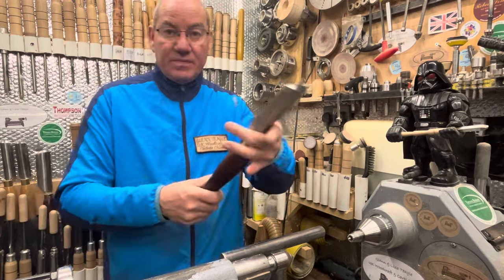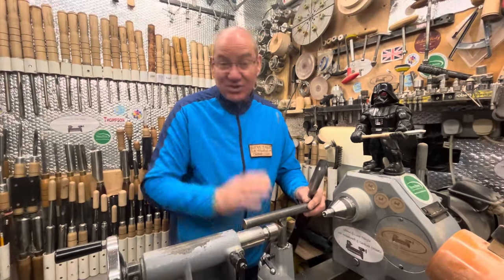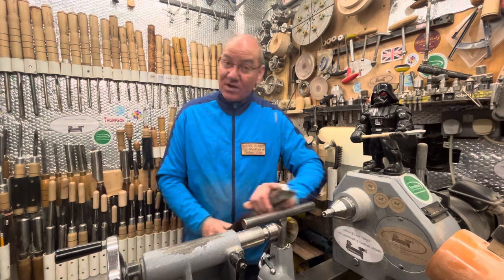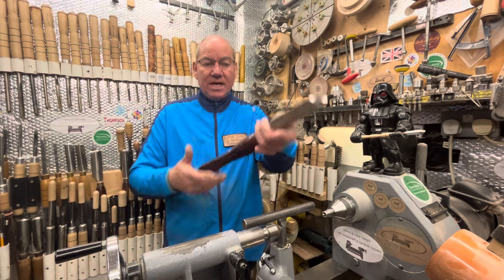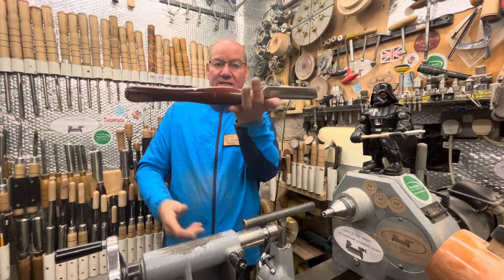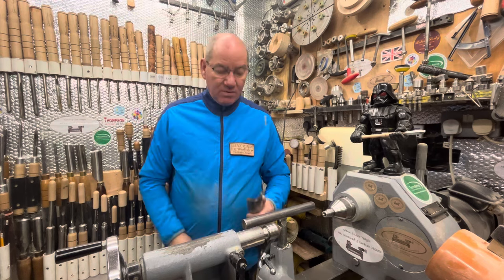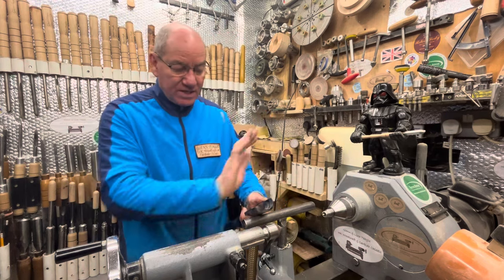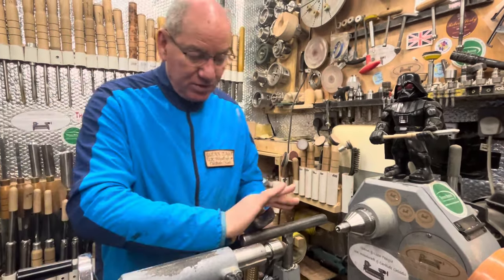Jennifer came and had a lesson with me, and I got her to do it first, so she showed me how she roughs. So right, okay, now try this. Put the tool on your hand, so it sits nice and comfy. Put that hand there. All that does is stop the chips coming back at you. We come onto the tool rest. We're here, okay? Up nice, close, personal.